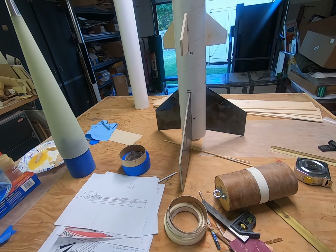Okay, balsa stripper tool here. I've had it for years. The way it works, it just screws in and out for the thickness of the strip that you want. So you can do this 2 ways. You can look on a ruler or scale and set it. This is really hard to do with one hand. So that looks like that's about 1/2 inch, because that's what I want. I want 1/2 inch wide. I'll stack the 2 1/4 inch thick pieces together and it'll make a 1/2 by 1/2 square stick.